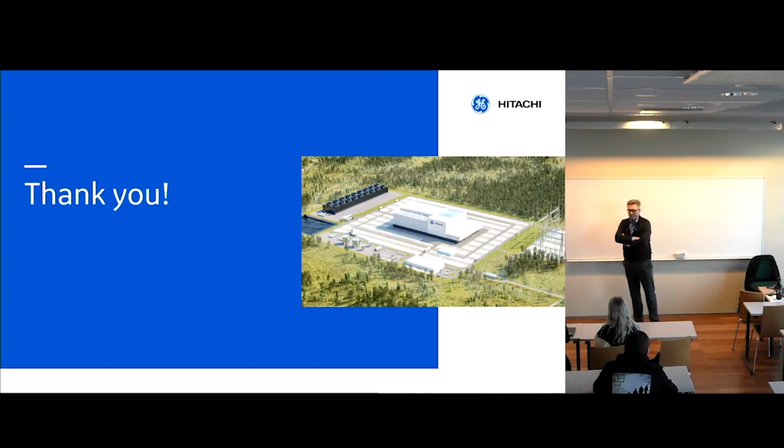So it'll be interesting. I can just tell you that where I worked, we had to do 20 manual actions within the first 20 minutes of the event. We had 2 people just going around checking stuff, making sure they were in manual or whatever it was. And here we have nothing to do other than post-SCRAM. You would verify equipment configuration and that you're in a safe operating condition, and then you would sit down and start writing the report, what happened, that kind of thing. Yeah. It'll be interesting to see how the training program gets going and how it trains the operators to trust the machine.